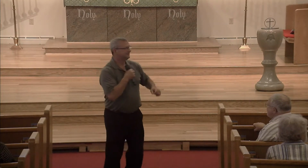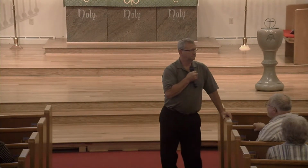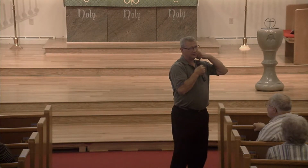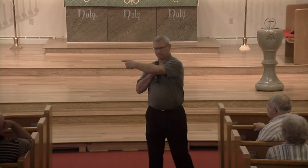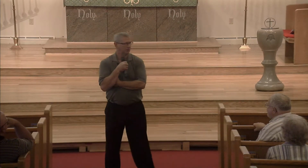Henry, you indicated at council that these would be set up at some point if we ever wanted to do a card access. Yes. It still is. The only bad thing is I can't get it on the front doors. It would have to be on either the altar guild door or the kitchen door if we put a fob or whatever we want to put in to be able to get in with a keyless entry, they call it. Because of the middle mullion coming out, we can't put any wiring in that way. But there is options for us. I'm going to have wire already put in when they do the frames, so that when and if we ever do that, it will be ready to go. Because in the future, it's going to be the way to do it.